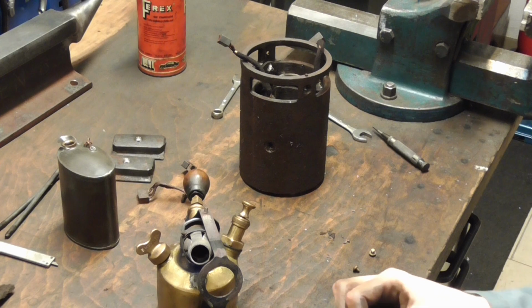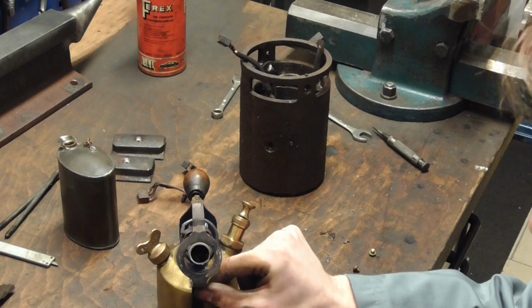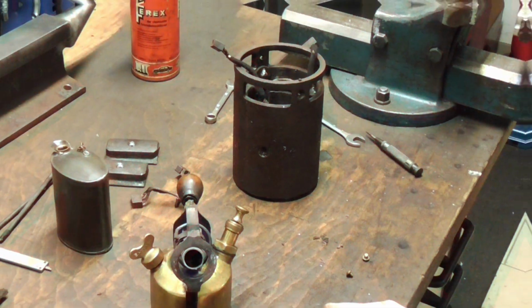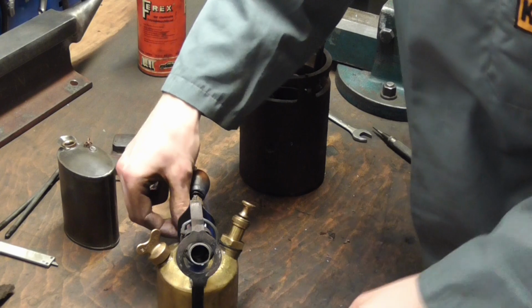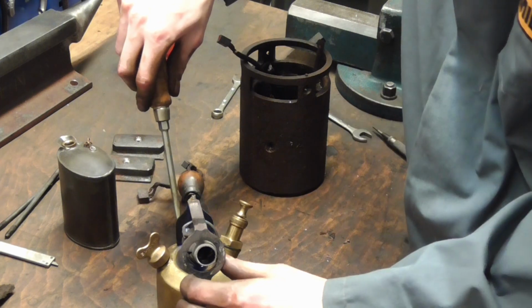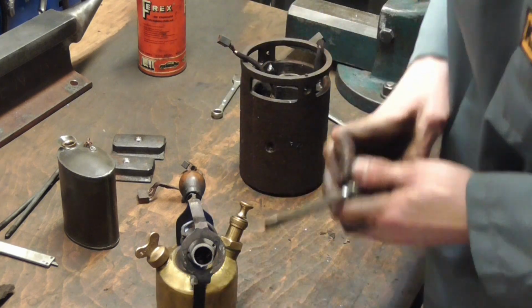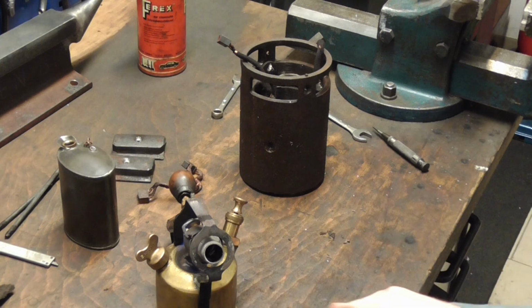I did learn a little bit in the meantime, and by now I'm happily able to say that I am capable of operating one of these. The key error that I made was having the soldering iron way, way too hot. I heated it up until it was glowing red, and that's too much when you just want to soft solder pieces together. What you actually want is this thing just hot enough to, well, melt the solder, obviously.